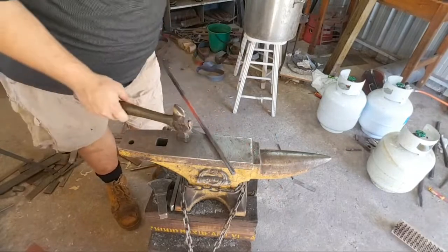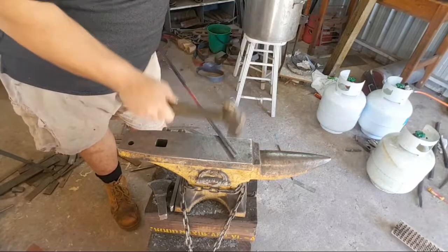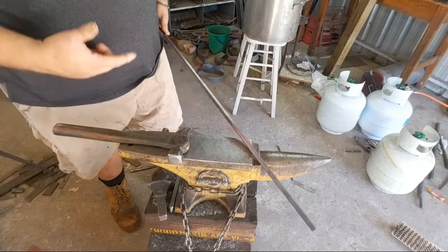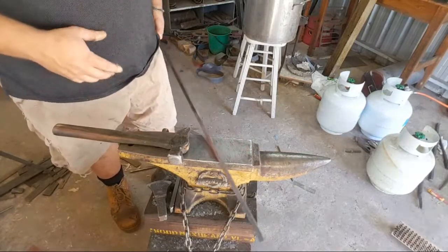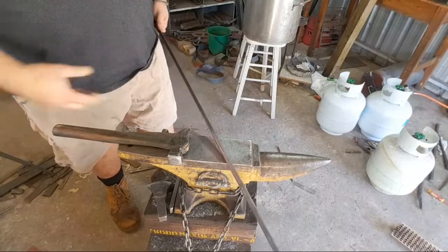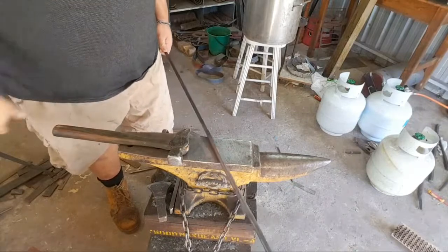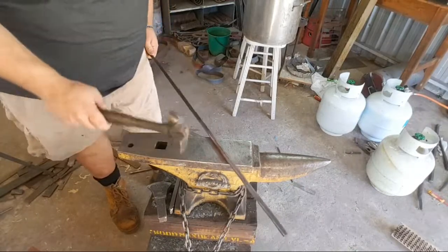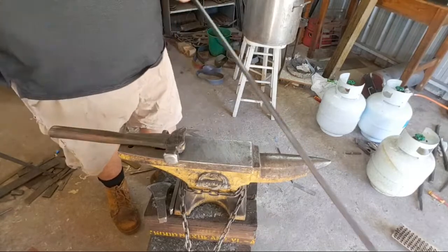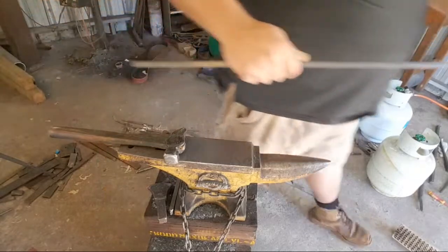The process I'm doing is called rough rounding, because I'm not aiming for perfectly round, I just want it roughly round. So I'm only taking it to octagon and then I'm just spinning it round, which leaves a lot more facets than if you took it to 16 faces and then rounded it. But I have to care a little bit more. Cut it off the jaw.